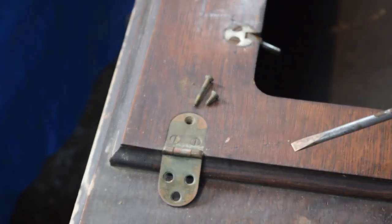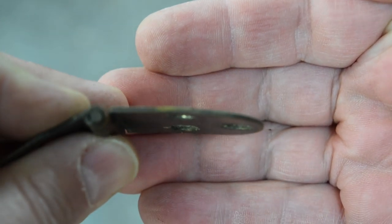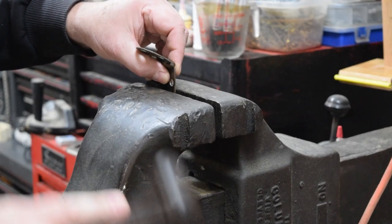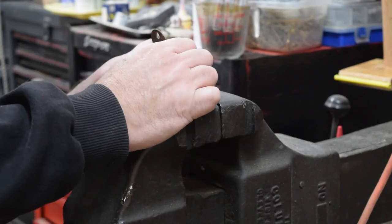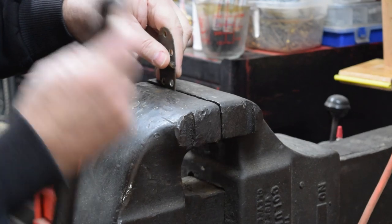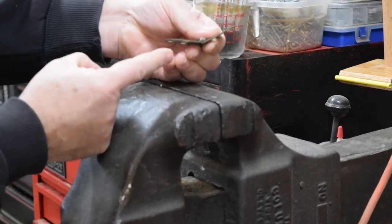I'm going to pull these off and we'll get this flipped over. And here's the hinge that we took off, and if you can see, it's bent. So I'm just going to put this in the vise and bend it back straight. That'll do.